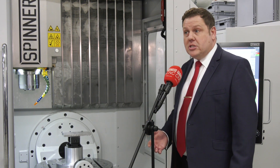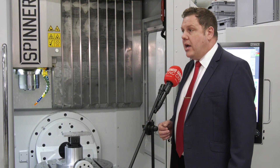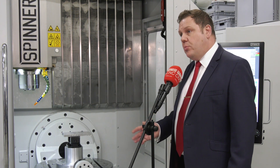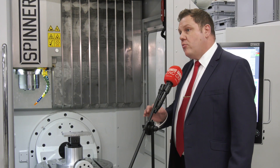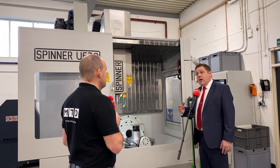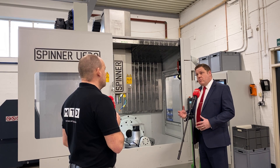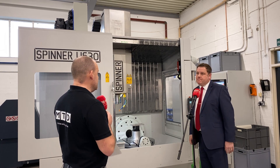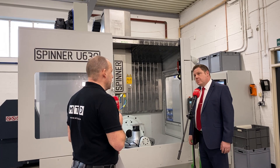One of our applications team had been doing an application on a blade-style component, and he was achieving less than 1 Ra surface finish with that kind of setup — long cycle time, but the finish was absolutely phenomenal. It plays into the rigidity and capability of the machine. Being able to remove this ring means shorter tool lengths, better accuracy, better surface finish. And it's easy to do — just a series of bolts to undo, take it off, and you're in a new configuration.